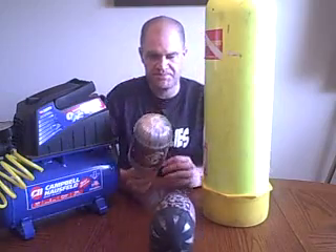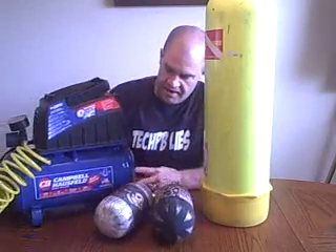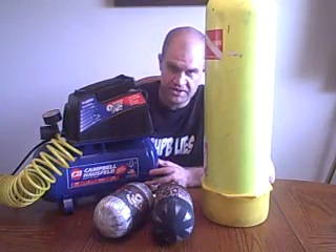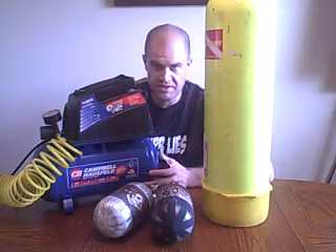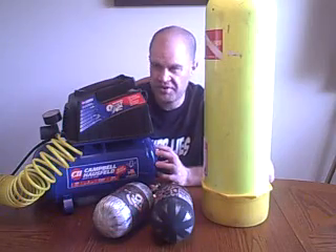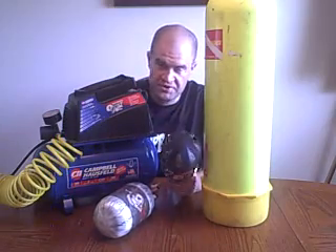The reason why is these tanks — the high pressure air systems — run anywhere between 3,000 or 4,500 PSI. These little guys you can get from Walmart or a discount auto store only fill up to maybe about 110, 120 PSI. If you put 3,000 PSI into this little dinky aluminum reservoir, this thing would turn into a bomb — it would explode. It's just not meant to do it. It's meant to fill up your car tires, your bicycle tires, which are meant to run at about 30 to 40 PSI, not 4,500 PSI.